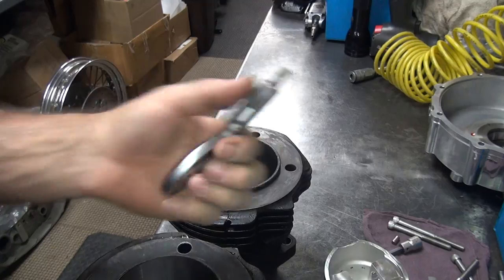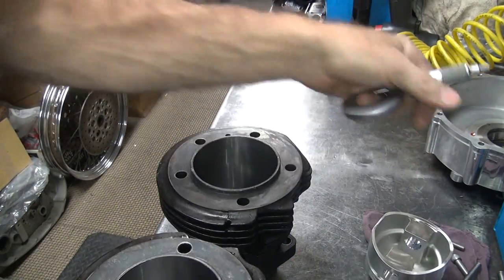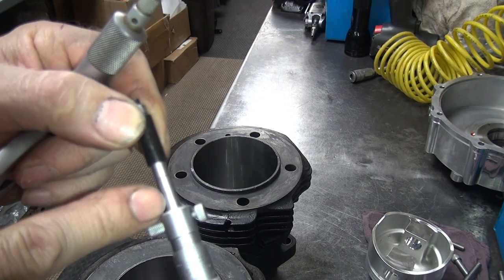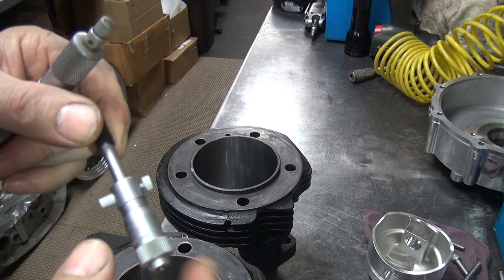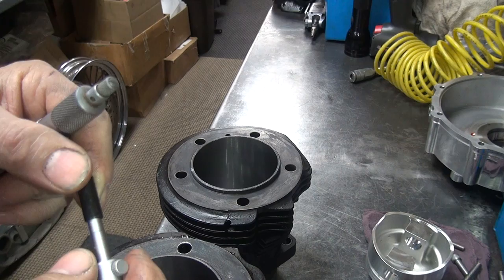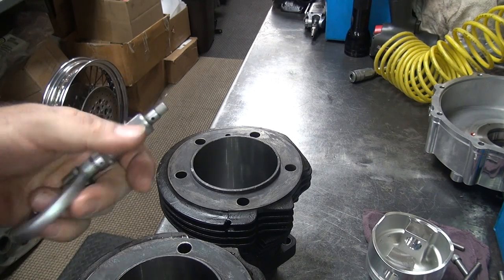Here's a three-to-four mic that's measuring something between three and four inches in diameter. This is an inside mic, and they're adjustable by taking out spacers and different length stands to get different ranges. This kit will go anywhere from about an inch and three-quarter up to six inch, so you have to pick the one within a half inch of what you're going to measure.